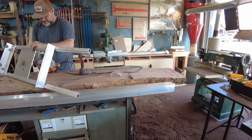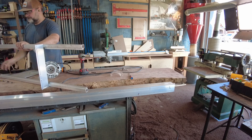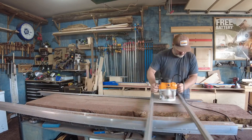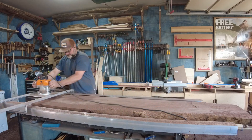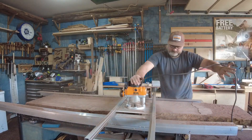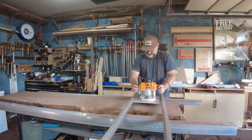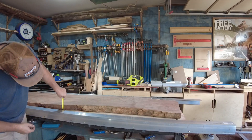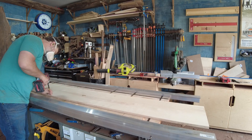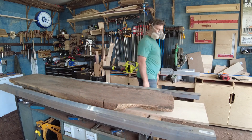Shooting for about two inches thick — anything over that seems a little bit overkill on a tabletop. This is where I end up being limited on my depth of cut because the arbor can actually travel through the flat stock the router is attached to, so I had to make that hole bigger to get back to work and cut deeper. Another thing I may do down the line is come up with some type of cord management — I had to constantly move the cord to make sure I didn't cut it with the router. Maybe something overhead could help. That's one of the two slabs complete. On the second slab I added a three-quarter inch piece of plywood underneath to raise it up a little bit, making it easier to make deeper cuts.